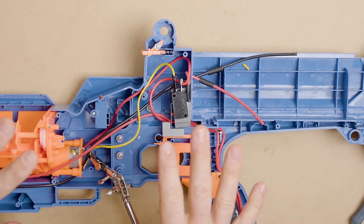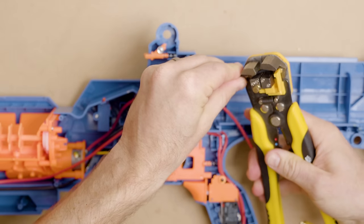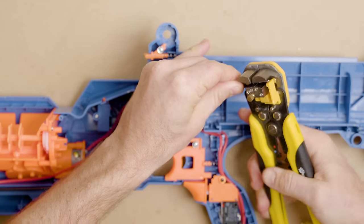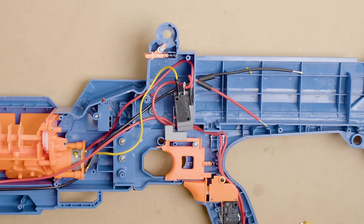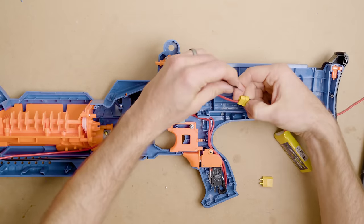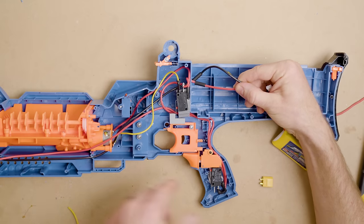In theory, we've now finished everything but the XT60. Before I do that, I'll strip these wires. XT60 connectors — go a little longer than you think you need. These auto-stripping tools are a lifesaver, especially if you're building 10 of these in one day. Before wiring up the XT60 connector, I want to make sure polarity and everything looks good. Be careful doing this with a LiPo — you could short out if you're not careful. Checking spin direction — those are great.